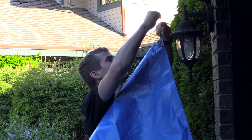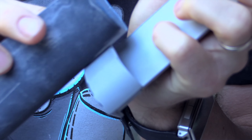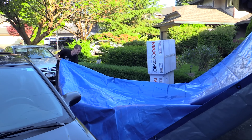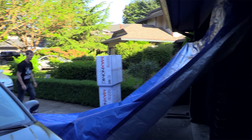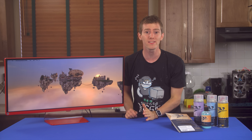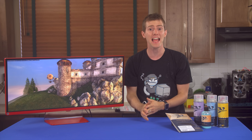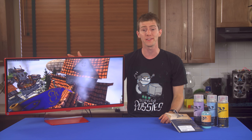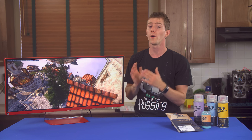Now you need to step up your game. Our painting location wasn't good enough, and we didn't have an anti-static treatment for our panels, which means dust was a real hassle over the next few steps where every mistake has a chance of showing up in the finished product. We helped ourselves by covering our work area with a tarp, but we'd still get dust problems with almost every coat. The best advice: no matter how tempted you are, don't try to fix anything while the paint is wet. Wait until the coat dries — you can usually get little bits of dust out with the tack rag.